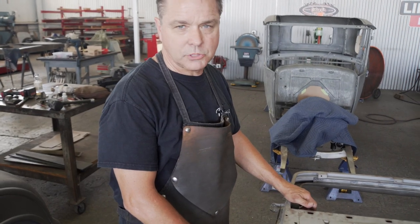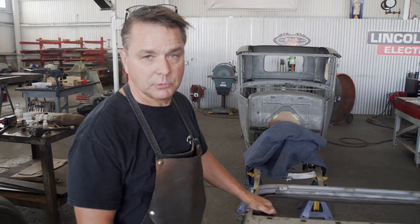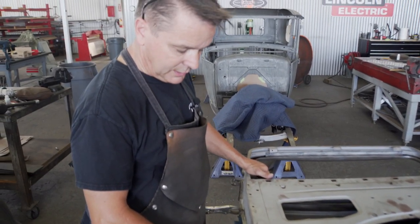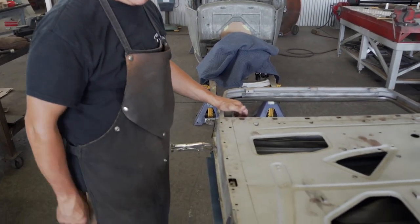I'm going to use my flanging machine. So I'm going to put the dies in it, the 3/8 flanging dies. We're going to run a little test sample, and that'll tell us where the break line is on the die. So that'll give us the correct amount of space that we need to scribe for our flange.